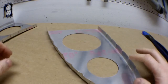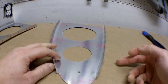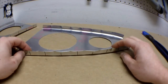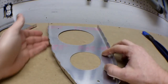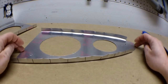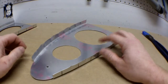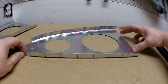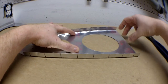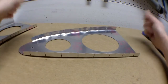It's not perfect. What we would typically do is go back and try to set this to 90 degrees, or as close as you can eyeball it. Some people hit it up against wood. What I'll do is hit these back up again to about 90. We're going to be doing any additional squeezing that we need to do, which will take a little bit of this slop out. But bear in mind, it doesn't have to be to the millimeter perfect. We are going to be putting in some rib stiffeners in these two areas here of the nose rib. It'll actually attach to the spar over here as well, which will give you some rigidity and help with a little bit of the bowing that you have.